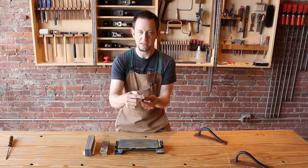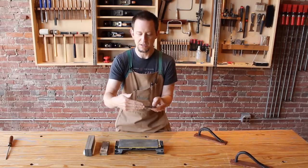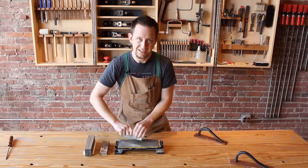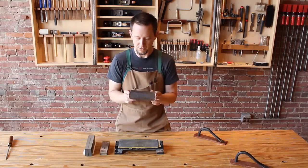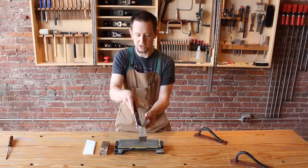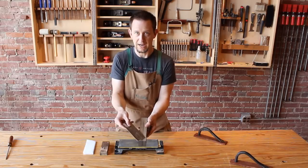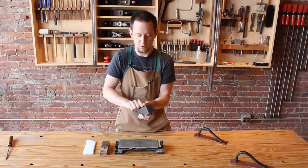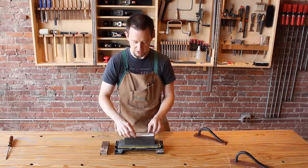How do we make sure that we get consistent results when we're polishing the edge? The edge needs to be just as highly polished as the face, but it also needs to be at 90 degrees to the face. Trying to hold that in your hand at 90 degrees is fairly difficult — you can do it, but instead it's much easier to build this simple jig. This is just a block of wood with a bandsaw kerf cut down the center, and I've put a screw across the two halves so that I can tighten or loosen the kerf. The kerf is just wide enough so that our scraper slides in and it holds the scraper securely while we polish the edge.